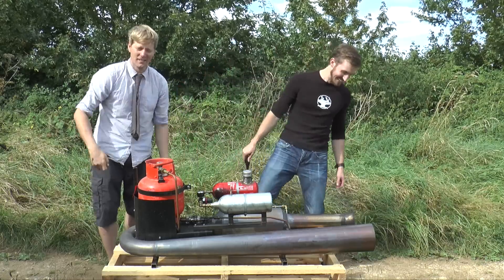He did it — he started it! Now, if all you're getting is pops and bangs, chances are your leaf blower is not powerful enough or your gas bottle is nearly empty. You need a decent amount of gas to get these things to run, especially one this size. The smaller ones obviously need less, but one this big you want a nice full bottle.